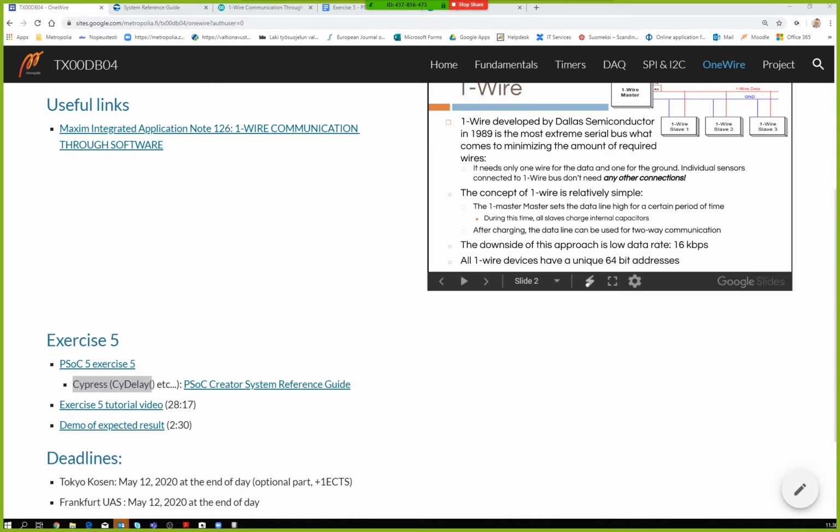Okay, one more thing. What is the best way to convert LSB and MSB into float value? Well, I would first go MSB times 256 plus LSB, and that's actually a uint16 type of value. Just calculate directly the value. And for the floating point, there's the conversion in that device data sheet. It gives actually the conversion rate. It depends on the device accuracy. When it turns on, and if you haven't rewritten this code, then it basically should be in 12-bit mode.